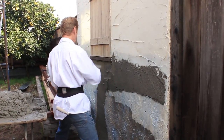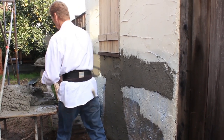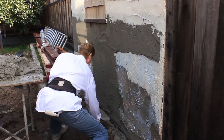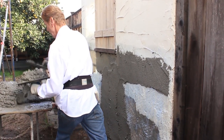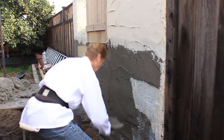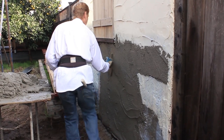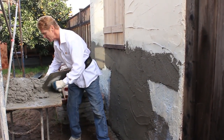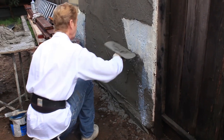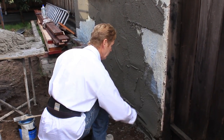We're going to show you how we put this texture in here, but it's a cold day today — about 45 degrees, 7 in the morning, December — so about 45 minutes to allow this to dry. If it were 100 degrees, I could do this and put my texture in almost immediately. But we have to account for weather. A lot of you guys say, hey Kirk, I tried to do what you did and can't. Well, that's just time in — time in practice, season after season, getting used to what the weather conditions are and how they affect the drying of the stucco.